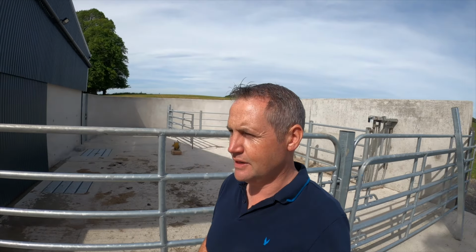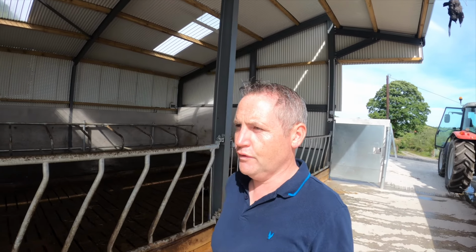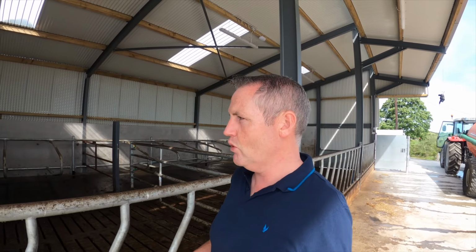I may even bring a second barrel over and let them fill for a while before I start washing. That way at least I have a little bit of water ahead of myself, and I can keep washing for longer. At home, no problem, the water flow would outrun what the pressure washer would use, but here it's the opposite way around. The pressure washer would use a little bit more than what the tap can provide, so you would run out of water.